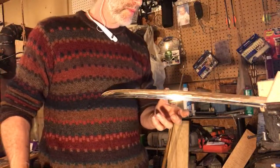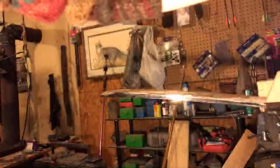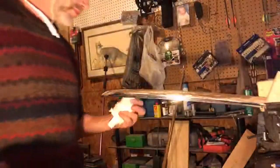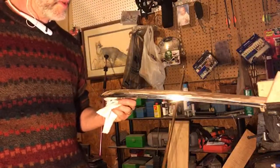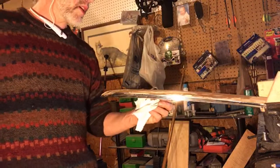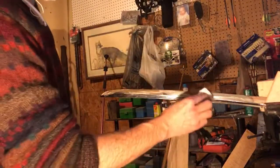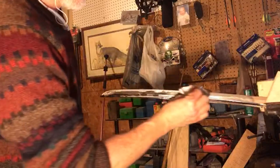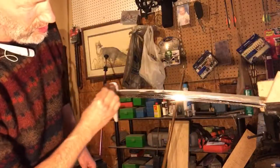Now I'm feeling for the burr, and I want to feel it equally along the whole side. And if the gum of your sharpening stone has built up on the far side, then you can clean that off so that we can feel for sure. Always be very careful to brush away from the edge. Look how my thumb is kind of growing as it goes down. That means I can't cut myself as I make that stroke. Ever eaten food, like peanut butter, off of a really sharp hunting knife? You can do that as long as you go away from the edge, like that. And if you go straight with the edge, or even worse, against the edge, you're going to add more iron to your food than you probably meant to.